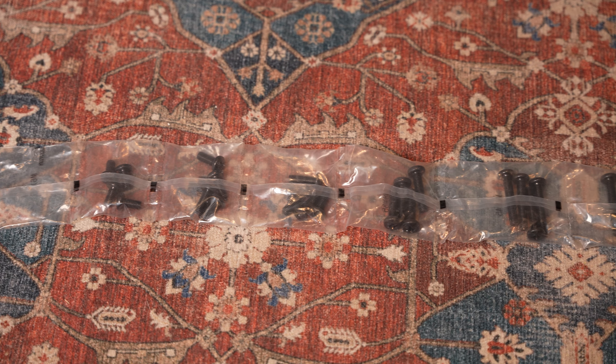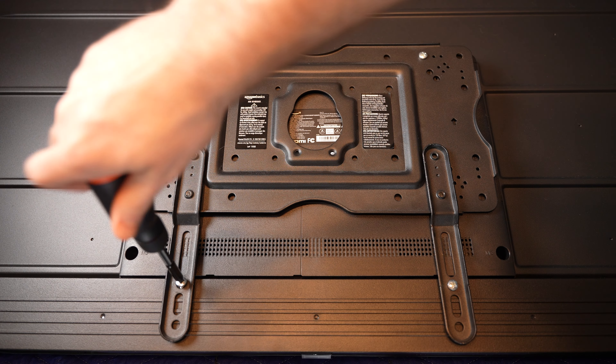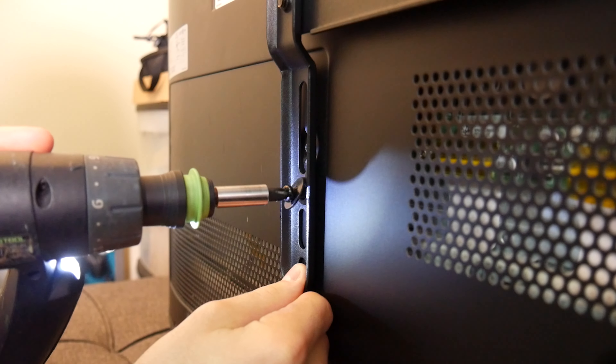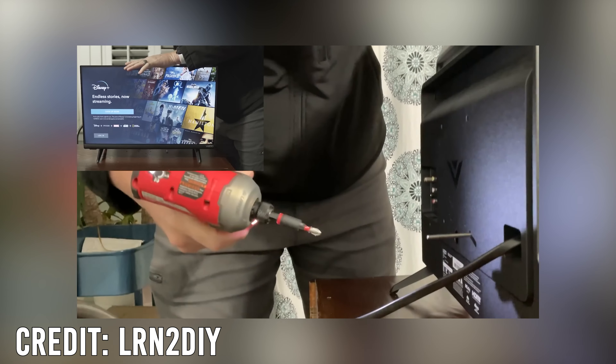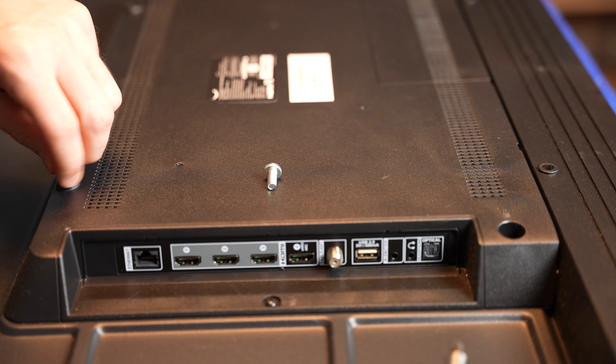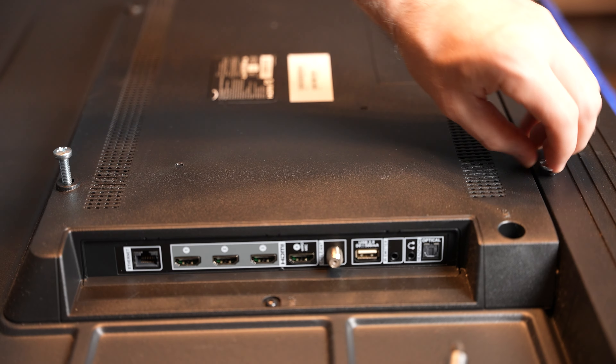Continuing on with securing the mount to the wall — you'll want to make sure that the screws attaching the brackets to the back of the TV are the correct length and that you don't over-tighten them. There are four screws in total that hold the bracket or brackets to the back of a TV. The mount should come with a large package of different size and length screws to use. I suggest that you hand-tighten them with a normal screwdriver or a power drill with a torque control set to a very low setting. Most modern TVs have mastered this design point where it's actually quite difficult to damage the screen itself by using screws that are too long. For finding the correct length of screw, you can use one of the longer screws in the provided pack to determine how long the inserts are, then choose the smaller screw that will have a lot of bite into the insert but won't be too long.